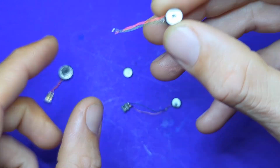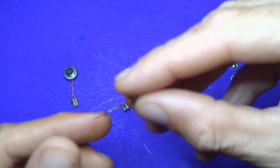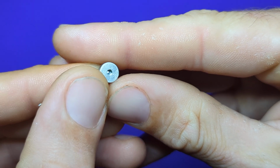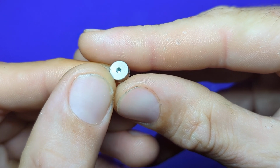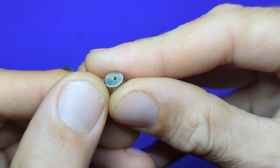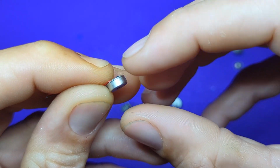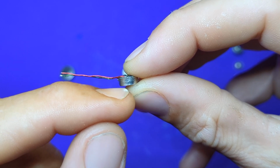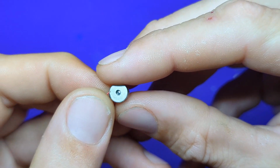It's kind of hard to explain, but you have moving coils in these drivers here, these flat panel drivers. There is no moving coil in this driver here. There's a moving plate. The coils are standard, so they're like stators, basically. They stay in position. They don't move at all. You have two permanent magnets, and then you have two field coils, and then there's a plate in the middle, and the two field coils, with the help of the magnets, move this diaphragm in and out.